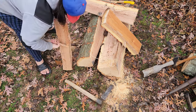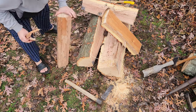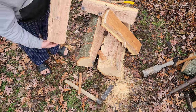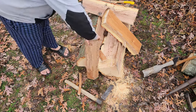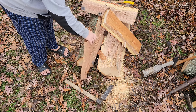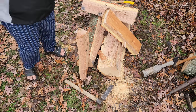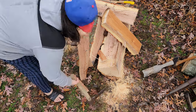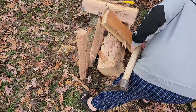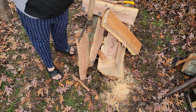The other part of processing is the drying process. Damn, I hate when I say the same word twice. Anyway, before you dry, well, you don't have to hew, but I've started hewing a lot more now. It just helps drying time, and it helps with cracking if you get rid of the squiggly stuff in the sapwood.